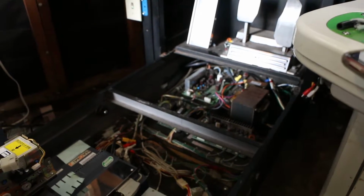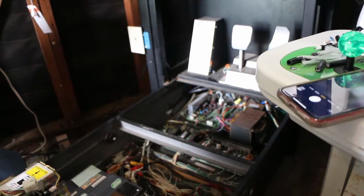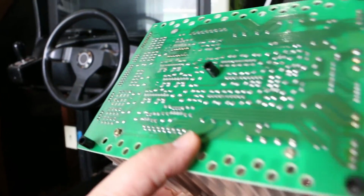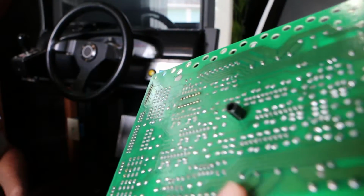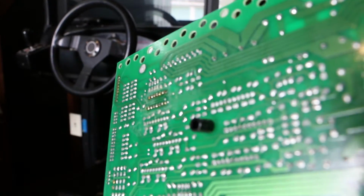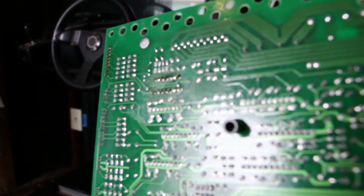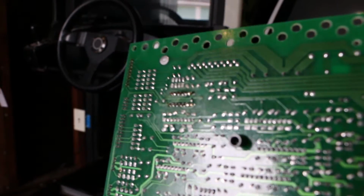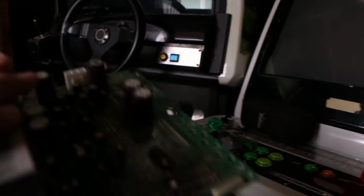there's that. We matched all the jumpers and stuff, but one interesting part is I looked at the traces on the back of the board, and it might be hard to see here. There's something bad happened to this board. It might be hard to see, but around the microcontroller, but I assume it's a microcontroller, there's some nastiness on the traces. So I think this board is shot.